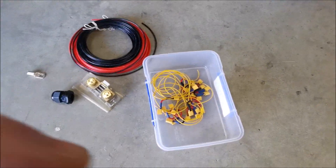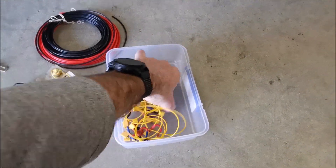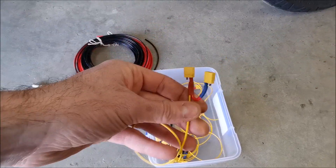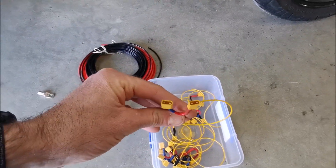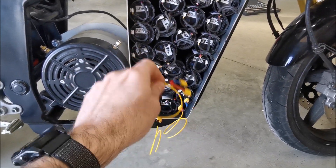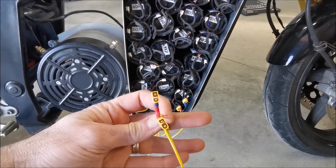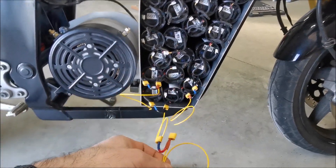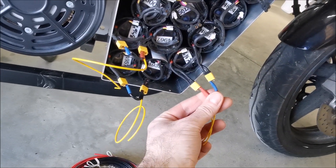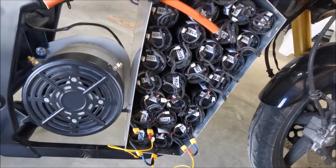During my procrastination I had a good chance to solder up a whole bunch of these little XT30 double-up connectors. The idea is that the tubes are 37 volts each and I want 72 volts, so I put two tubes in series using one of these — positive of one side connected to the negative of the other.